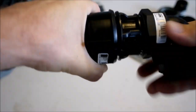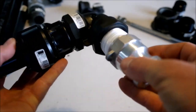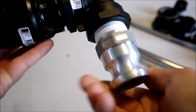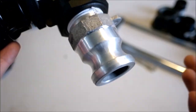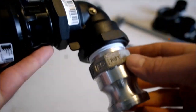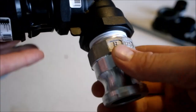Loosen this off, turn your poly in, put an elbow on there. If you want to keep it at 32mm, get a 32mm Camlock — simple, female, F-type. Searching for these on eBay: F-type Camlock 32mm. You can get them as cheap as $3.50 or as expensive as $30, depending on quality, country of origin — stainless steel, aluminium, or poly.